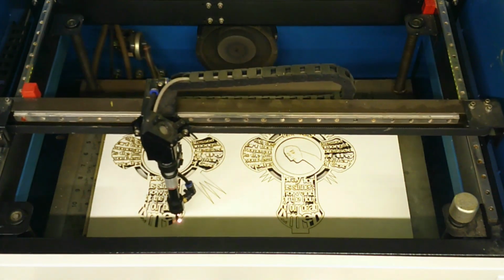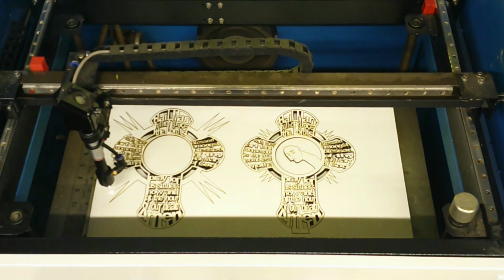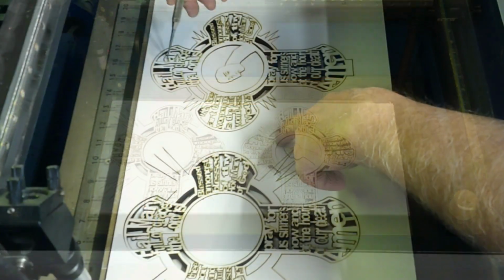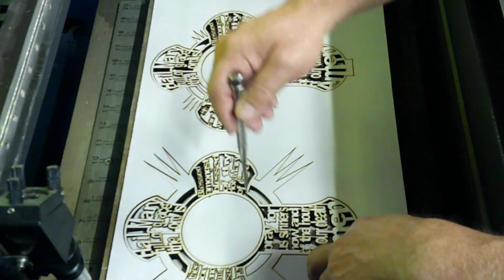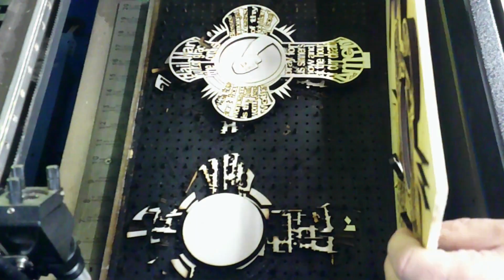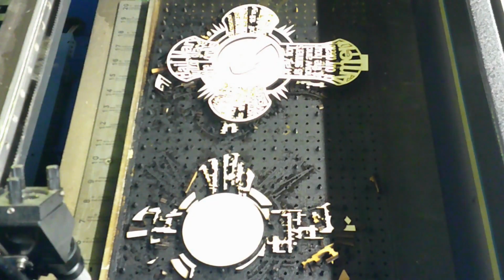The plywood was about 4.5 millimeters or 177 thousandths inches thick and cut to 12 inches by 20 inches from a 4 foot by 8 foot sheet for 16 pieces and 4 pieces that were 12 inches by 16 inches. There ended up being a lot of little pieces that I had to push through the design to get them out. I really liked having the bed of nails that I use for my laser, and it really supports the material being cut.